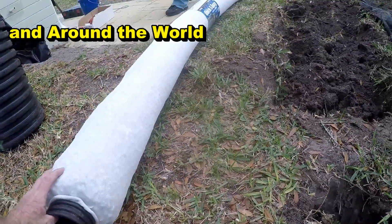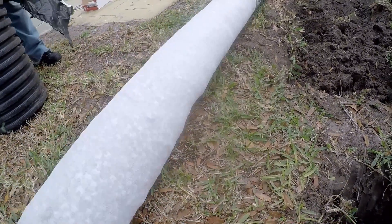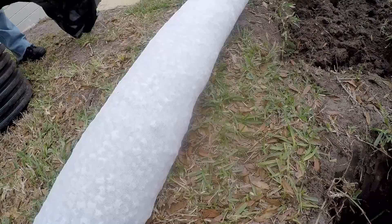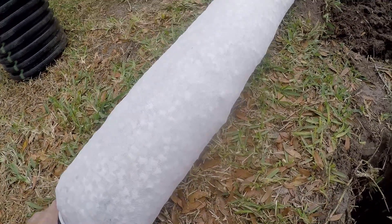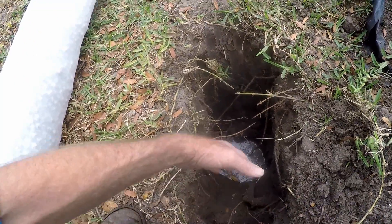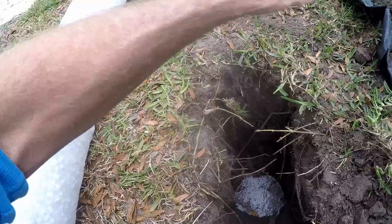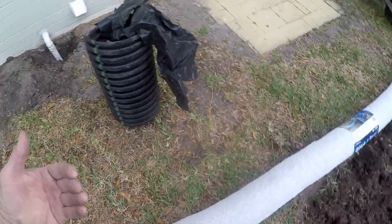Basically, what we're going to do is extend this drain field out just 10 more feet. We're going to use the Easy Flow drain — this is styrofoam peanuts that encase a four-inch perforated pipe. As water floods from this part of the drain field, it's going to enter our new system and leach out into that area over there. But the real problem is what's been happening inside, because of the phosphates and the tremendous smell.